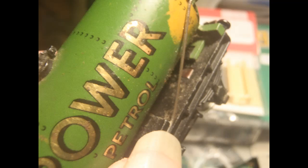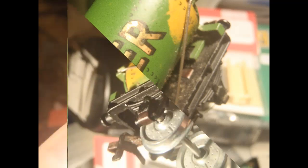These bearing parts are made from some kind of fairly thin sheet metal that's quite springy and bendable. The key to removing them is the little tab seen at top right here. That tab, bent over and flat on top of the chassis, is what holds the bearing piece in place. If you pry up that tab, you can pass it back through the slot in the chassis and remove the bearing piece. Here's the view from the bottom.